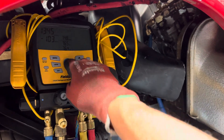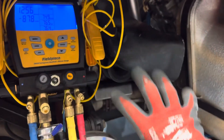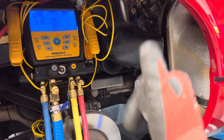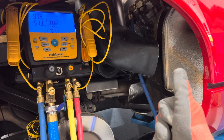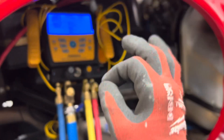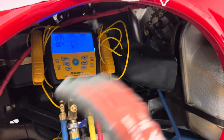Alright, I'll see you later when I fill this up. I'm not going to run it because the air intake is down and everything had to come out. I'm just going to fill it, charge it, and I know it's going to work — unless there's an expansion valve problem or an electrical problem. When I'm finished I know what I did: moisture-free, air-free, pure refrigerant, properly charged. When you hit that button it works every time unless there's an electrical or physical mechanical problem. I crossed every T and dotted every I — this is how you have no comebacks.